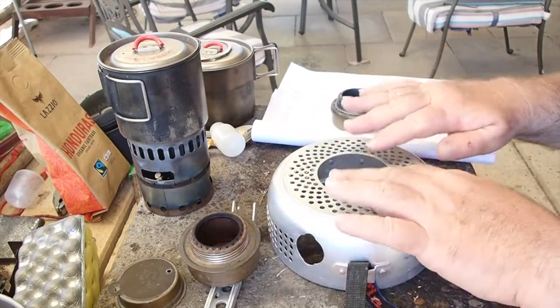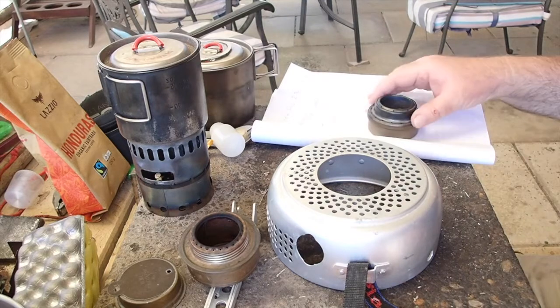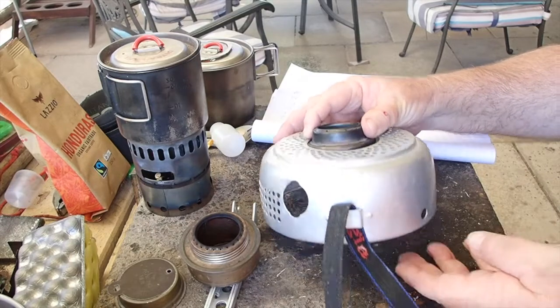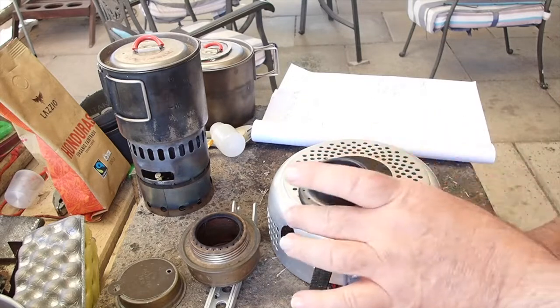The hole in the base of the stove is 70.8 millimeters. That's why it sort of sits there looking scared - when you push the leading edge in it's just like putting a tire on a rim that pops through. So you cannot do it that way; it is just not safe.